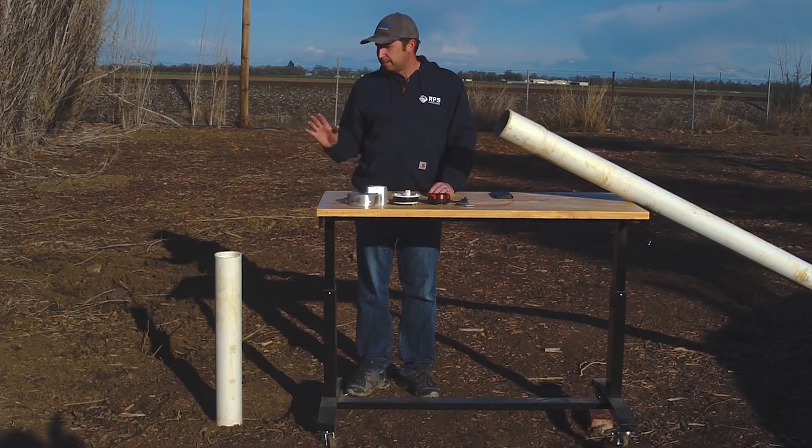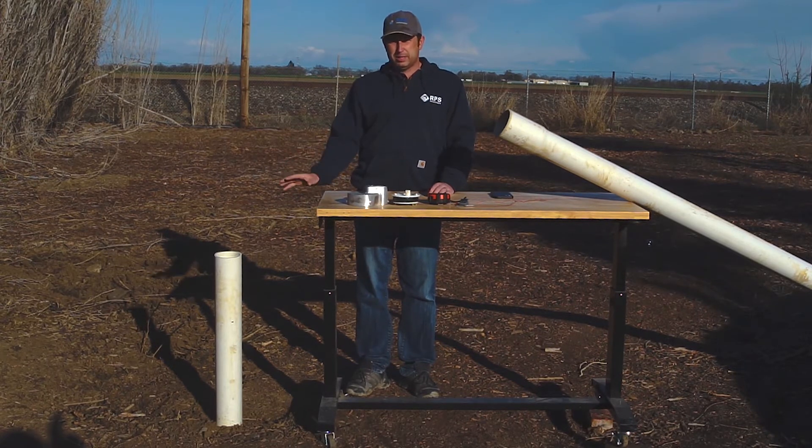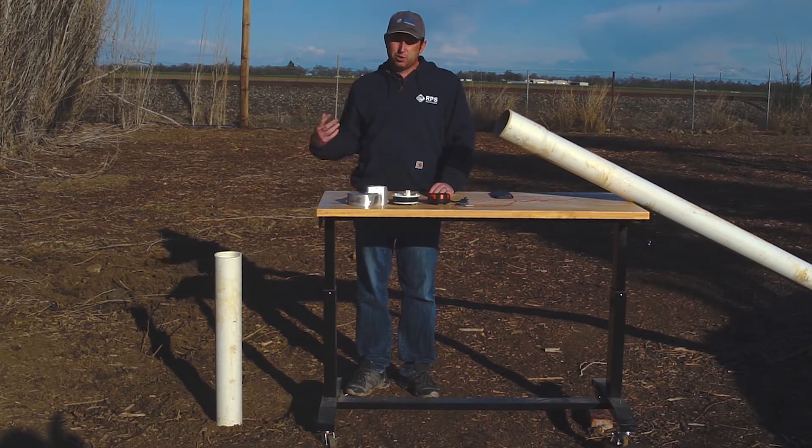If you're in a place with bedrock, they're going to bring the well casing down to the bedrock, and when they drill through the bedrock they're not going to case that because the rock itself acts as the casing and prevents anything from falling in. A majority of well casings are going to be PVC these days. A lot of older wells use metal casings, but most have switched to PVC due to its corrosion resistance because it's not going to rust over time.